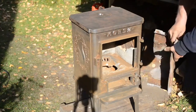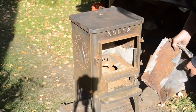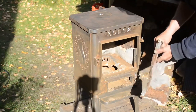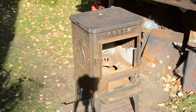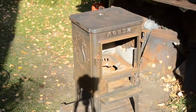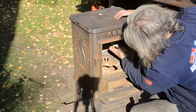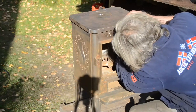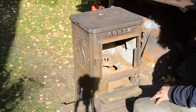Here you have the fire plate, but I'm going to cut here, there, and I put another straight piece here. It's good enough because this is just guiding the smoke, and it's intact here, even though it looks a little bent. And there are some stones that were cement stones, and they fall apart, but I figure I can reuse them, and it will be okay. I glue them in there with the cement and make it complete again.